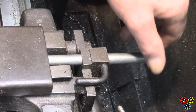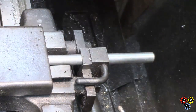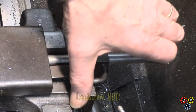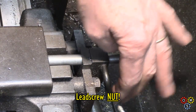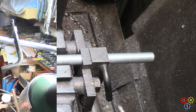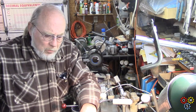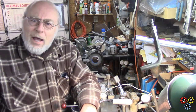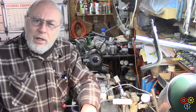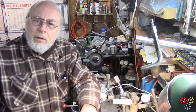I added this long ago. So I just unlock it and in the normal course of events that bar - half inch bar - will just push out. And that is - can you hear that? - that's up against the lead screw. So flip that round and lock it back to where we are. There you are, just something real quick there. Not all lathes would necessarily adapt to allow a cross slide stop to work the same as mine, although the principle is fairly simple. And the indicator on the compound I find very, very useful.